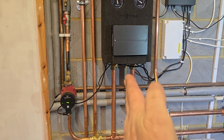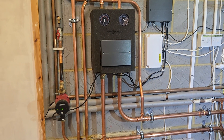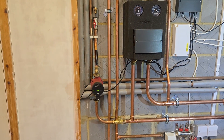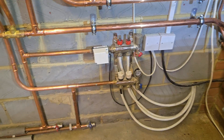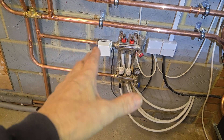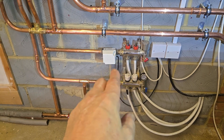Ideally we want two mixed circuits on these systems. If you've got really high-performing underfloor heating and really poor radiators it won't be an issue, but if you've got good radiators and poor-performing underfloor then you're definitely going to have an issue. That's more common in my experience - underfloor at the standard 150mm spacings, and the radiators are normally ready to run on a 1.4 curve, so fairly low temperature, heat pump ready in most cases.